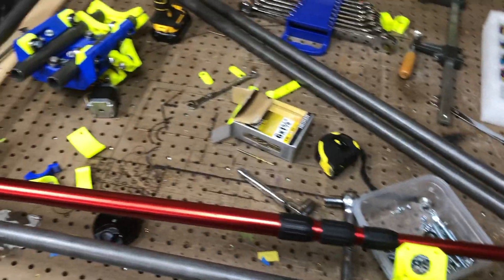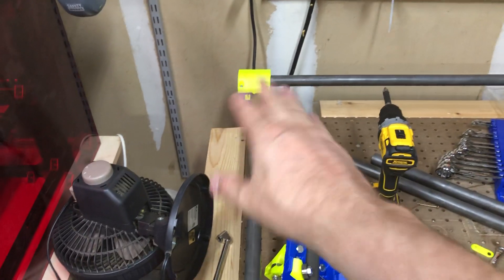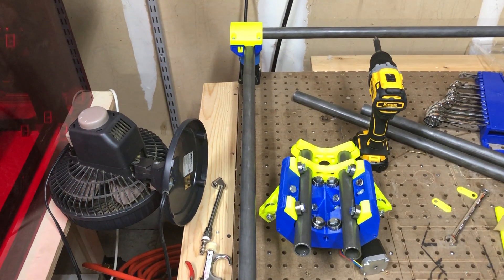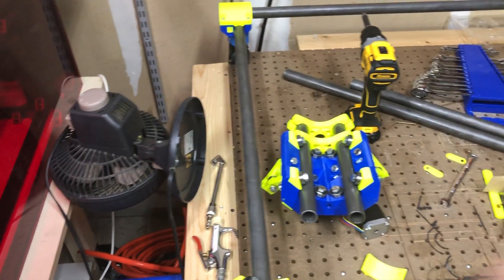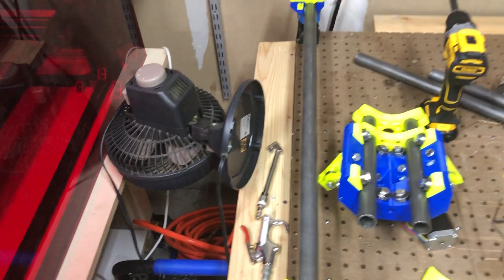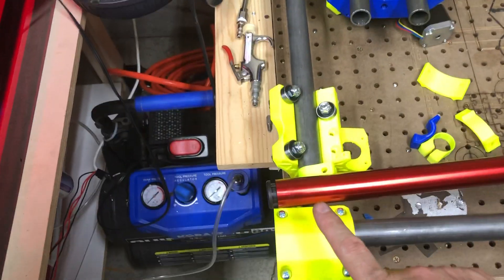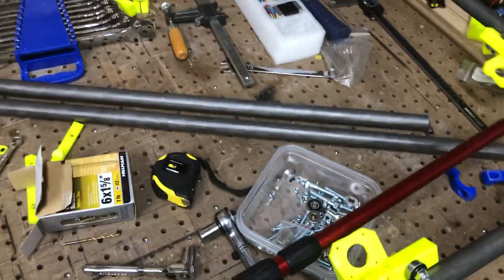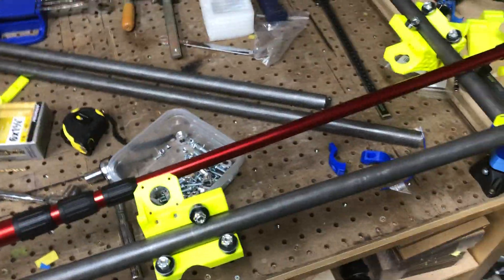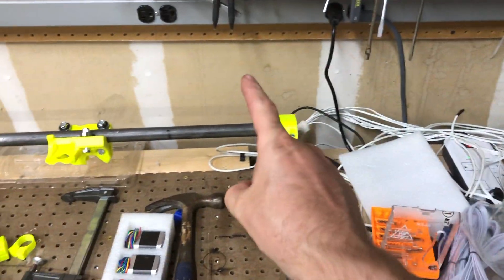With that distance set to match, I've got the same distance of travel along the axis. I set it up to just about the back edge of my table to get as much room as I could and screwed it down so that both bars can no longer move. I created a measurement point doing the same thing, but in this case my extendable stick was too long even when fully collapsed, so I used a wooden stick between those two points and marked it with a fine pencil, then made the other end match.